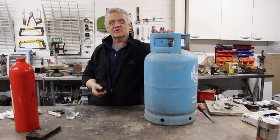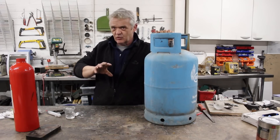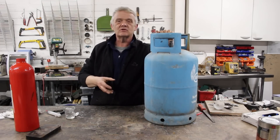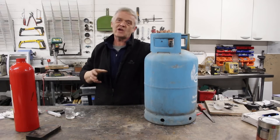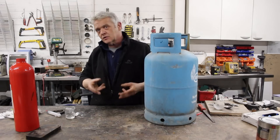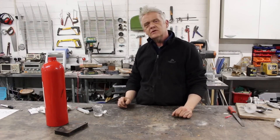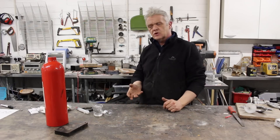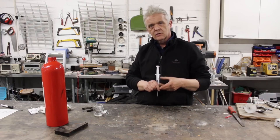If you're going to get to those kinds of pressures, you could ask: why not just use compressed air and forget about the water? That would be a perfectly valid question. What I'm pointing out is that if we can increase the pressure on water contained in a vessel, we can increase the power within that vessel. Using compressed air is the modern way accumulators work; weights on a piston is how the old accumulators worked — but we're still doing the same thing: supplying external pressure to raise the pressure of the water so that increased pressure results in more power at the nozzle. Water accumulators are also used extensively in industry — in drilling rigs, in the nuclear industry for delivering cooling water, and in a whole range of other situations.